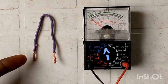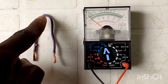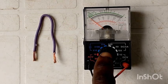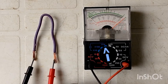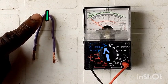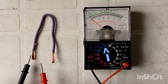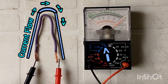Remember, if this wire is faulty — meaning the wire has a breakage inside — it will be hard for you to tell physically. So when you turn the knob to the resistance setting and check it, it is going to read. If it doesn't read, it shows the wire has a breakage inside, which means there is no continuity. That is how you check resistance in a circuit — it checks the continuity of the wire to see if it's okay.